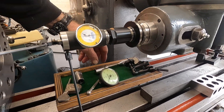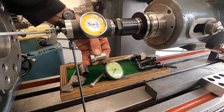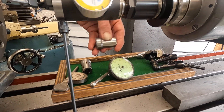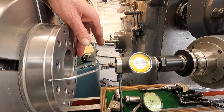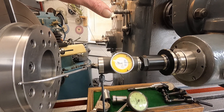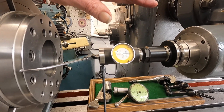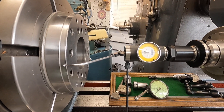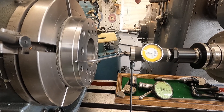The nature of an Erickson collet is you can cause things to run true and you can cause things to run untrue because of that little taper. I can cause this thing to run untrue pretty radically and still get an accurate reading. If I get it running so out of true it'll show two marks on the dial, but if I keep the indicator within those two marks I can get things running within a thousandth with patience. I actually spent two hours with this thing.